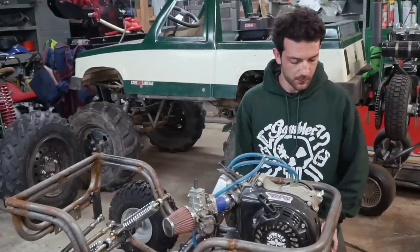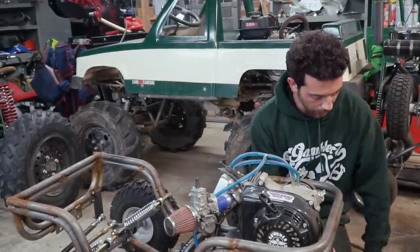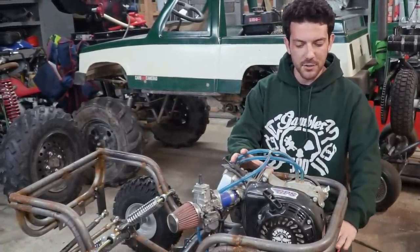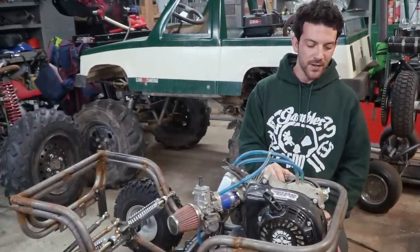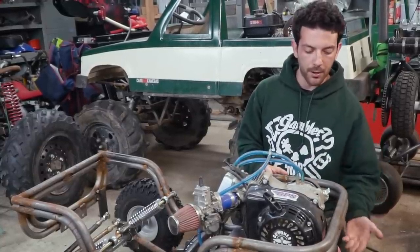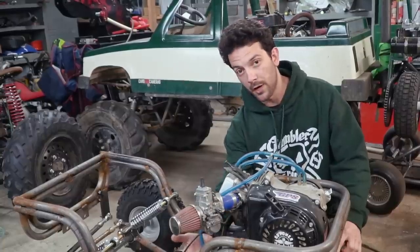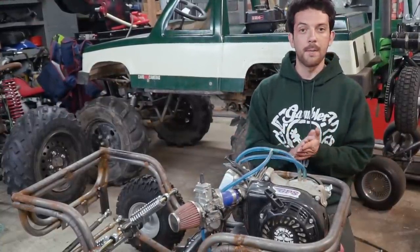We've been doing a lot of brainstorming this morning and we have a rough idea of how our four-wheel drive system is going to work. But before we can permanently mount anything, we need to mount our Tillotson 228 engine and engine plate, both from gopowersports.com — you can check them out at links in the description. Basically, the entire front suspension is going to be built off the bottom and sides of this heavy-duty engine plate, so we need some tubes that come down off the front of the frame and another tube crossways to mount to the back of the engine plate.